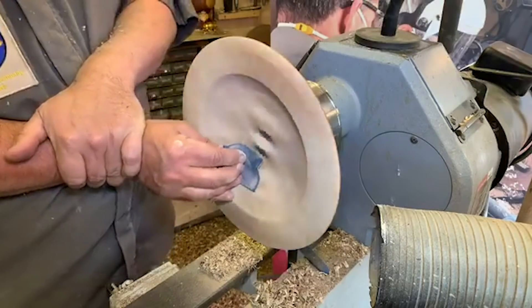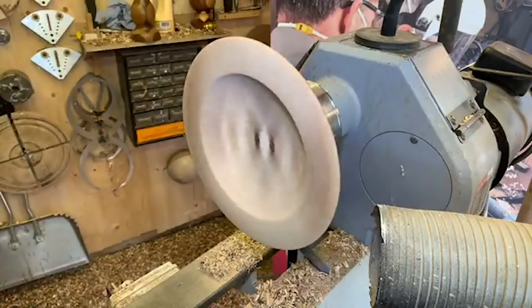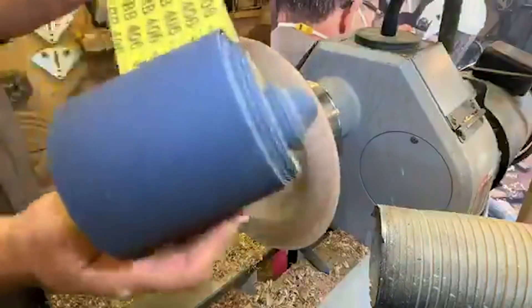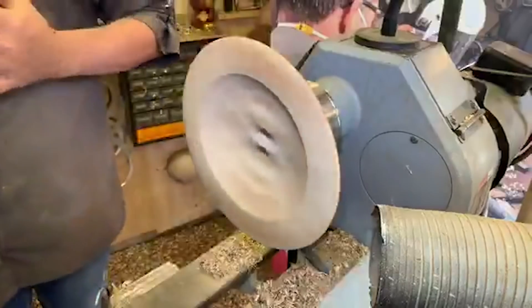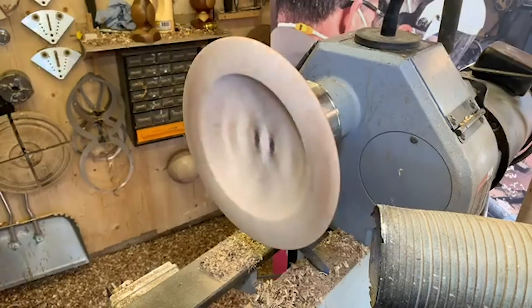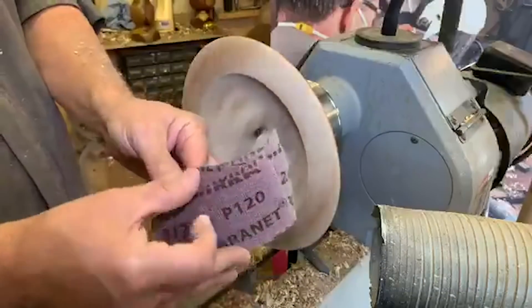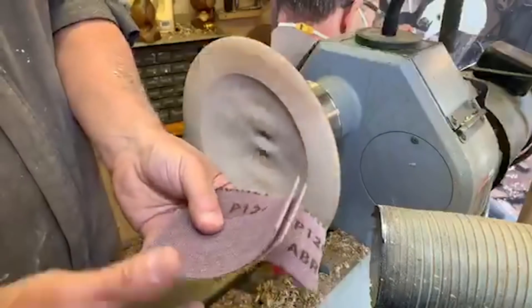What type of abrasive paper are you using? This abrasive is RB paper, known as the ultimate abrasive from Hermes — listed as the ultimate abrasive for woodturners. Alternatively, Abranet is another good one. That's quite good because it's perforated so you get less temperature build-up.